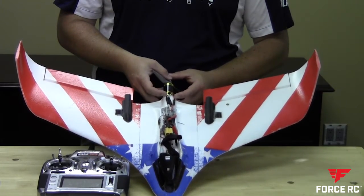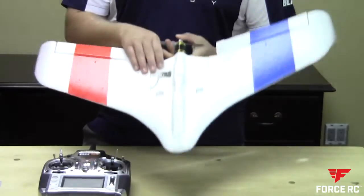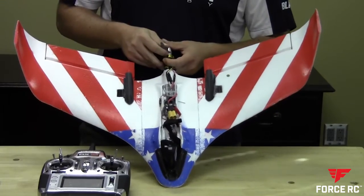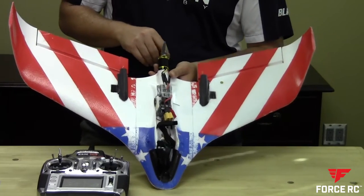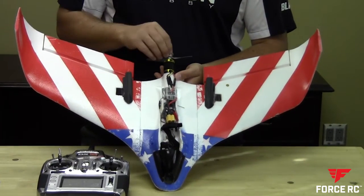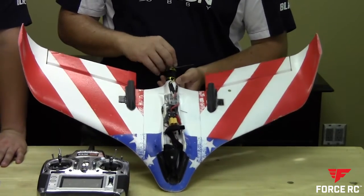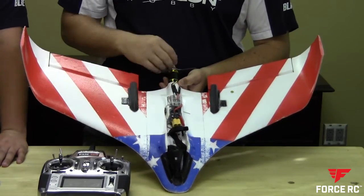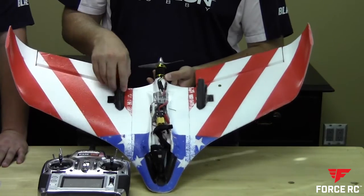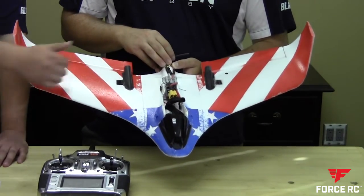When building the modified version, we didn't have to adjust the center of gravity much — it's got the dimples on the bottom for CG reference. We try to stay relatively right there, though we're actually a little bit behind it just because we couldn't get the batteries any farther forward. We couldn't really fit 1300s in there comfortably, but the 1000s fit perfectly with a little bit of foam cut out. We kept it as light as possible while still maintaining an acceptable CG. Wings are all stock — we cut about two millimeters out on each side to fit the 1000s, and a little bit back here to fit the bigger ESC. Just some hot glue and away you go. It's amazing what you can do with an X-Acto knife and hot glue on a foam wing. The 3D-print files are all on Thingiverse already under another Blade RC Thingiverse — we'll put links in the description.